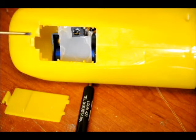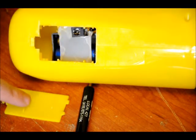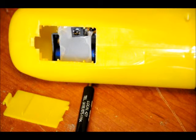The resistor bank is equivalent to about 2.5 ohms, 10 watt. You place your wall transformer input here — you obviously take the back housing off. This design is based on a 5 volt 3 amp wall transformer. So you plug it in and the caps won't ever be charged higher than 5 volts. It takes only about 5 minutes to charge, and you get about an hour's worth of full luminescence. In fact, you can keep this on for hours upon hours, but after a few hours it just won't be very bright anymore.